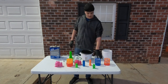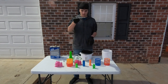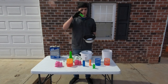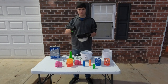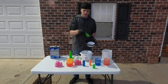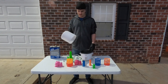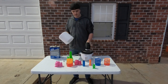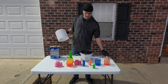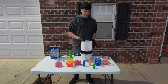So what I did to make this very suitable for acetone smoothing is I printed a little base that I can set down in there. That gets it off the bottom so you can pour acetone in there and it doesn't get to the part, and then you can put your part on top of there. For larger parts, since this right here is about that tall, it means for stuff like this — or even this — it doesn't work out very well.